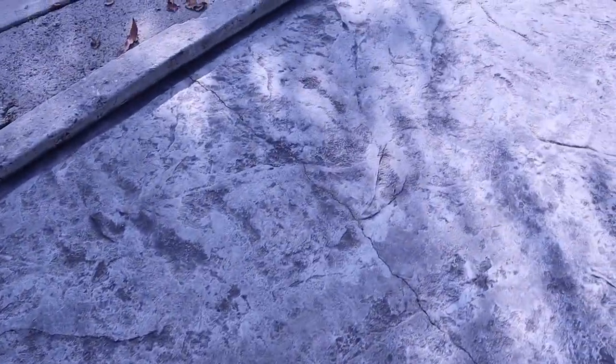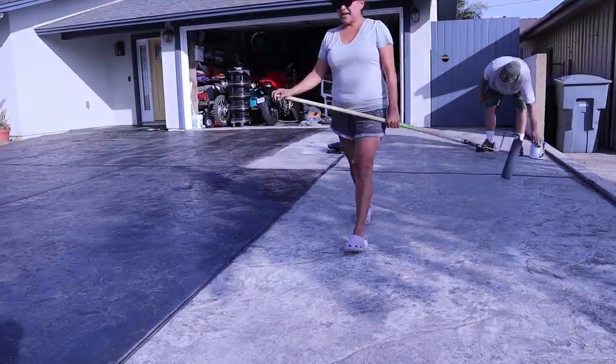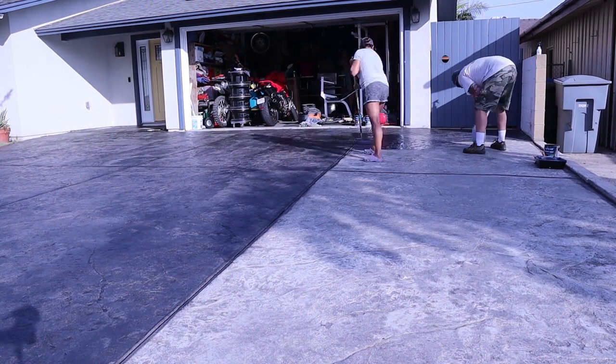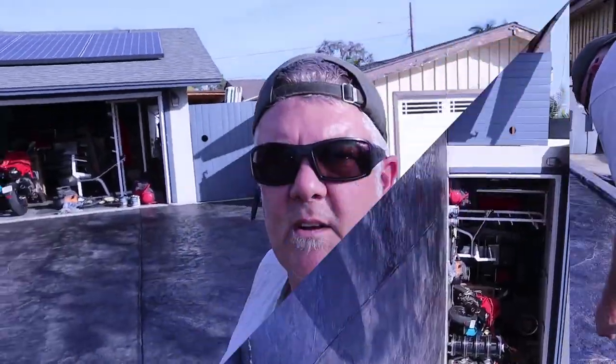So now we're going to go ahead and put it on. I've got my lovely better half here, she's going to be helping me out and we're going to spread this stuff around. A little bit of a learning curve here for me — I've never done the one-step stuff. I started putting it on with a roller, a nappy brush roller. Then I read the instructions — you know, guys don't need instructions, right? — and it says to put it on with a sprayer, and then you can use a roller afterwards to even it out. That definitely went a lot faster.